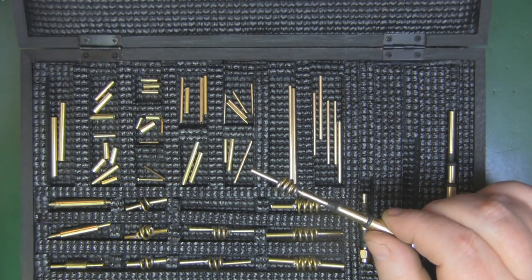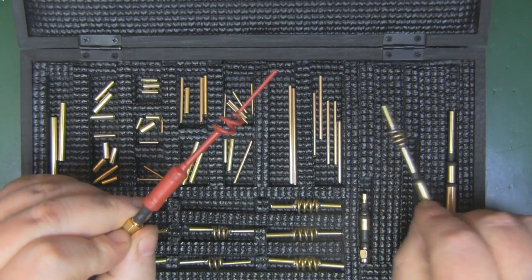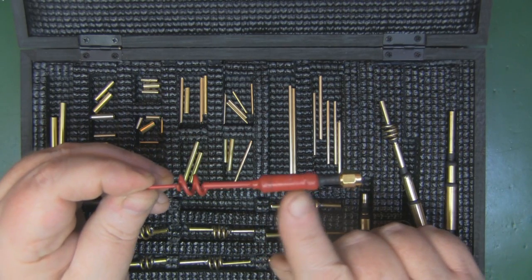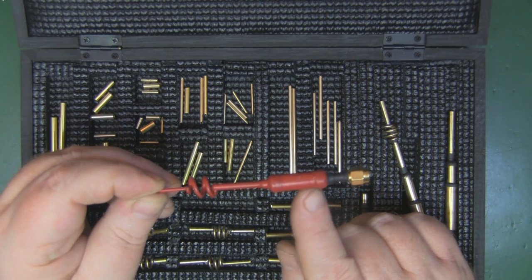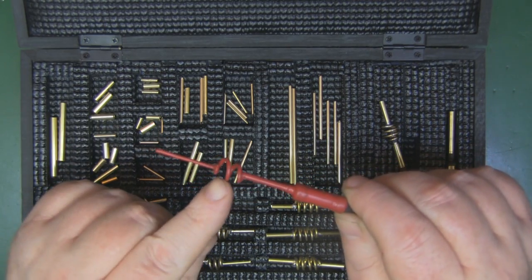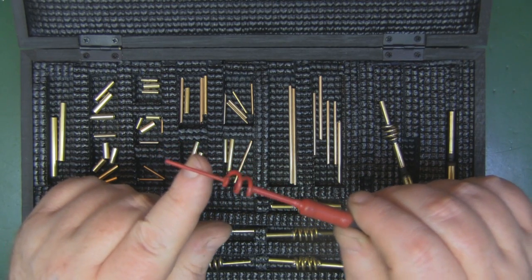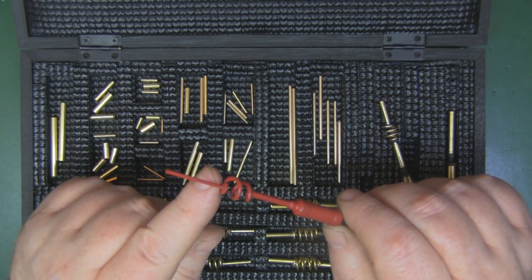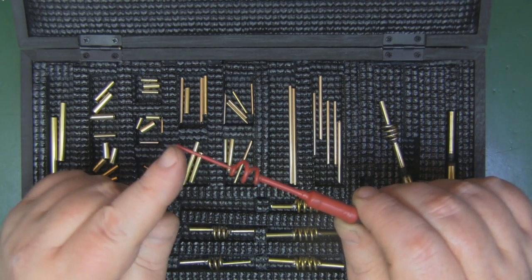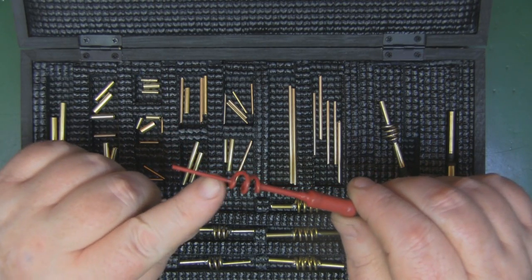But this dipole here is a design that I've come up with by using this development kit, and I probably would not have come up with these measurements previously. The ground plane on this is slightly less than the 25 millimeters it's supposed to be. It's at 24 millimeters, and the loading coil is different as well, and I wouldn't have chosen a loading coil like this. And the end driven element here is slightly shorter. This tends to be somewhere between 50, 60 or 70 millimeters if you ever dissect one that you purchase off eBay, for instance. And this is quite short.